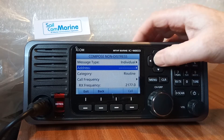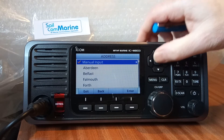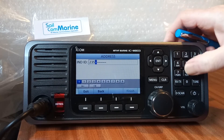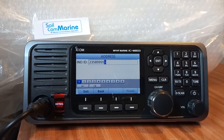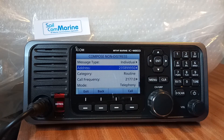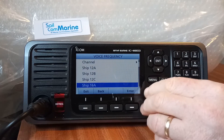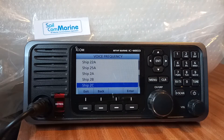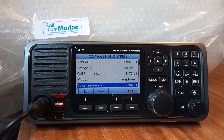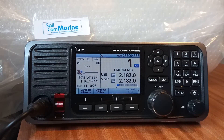Go into 'Address' and press Enter. Here at SARCOM Marine we program a range of shore stations and coast guards into the radio. Press Menu and we can enter the MMSI number of the other station we wish to call, then press Finish. For this individual call we can send the DSC on 2177, with voice communications on 2134. We can also go down the list and select a suitable voice channel — in this case the voice follow-up will be on 2306. Press the Call button to send, then wait for acknowledgement.